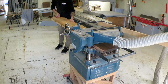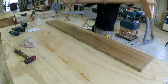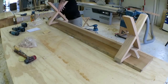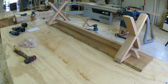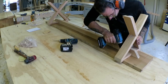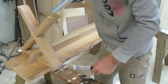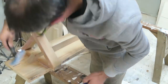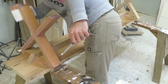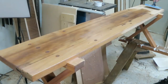With the epoxy dry, I could machine that off and then sand up the planks. Then I could put some water-based polyurethane over the whole lot - it's a super not-easy shape to finish. I'm just using a speed brush there, which is essentially just a sponge with a handle - a nice quick way to get a good finish.